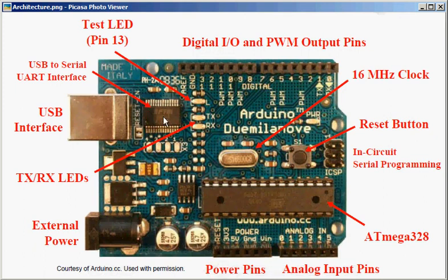This component is also one of the most important components — it is the USB to Serial UART interface. USB, as you know, is the Universal Serial Bus on your laptop. Your computer works at 2.5 GHz and your Arduino works at 16 MHz, so to get them in sync you need the UART interface. UART stands for Universal Asynchronous Receiver Transmitter. It clocks both the laptop and the Arduino to a common frequency so that they can communicate with each other.